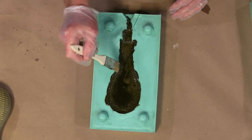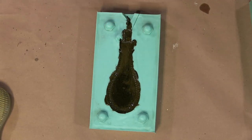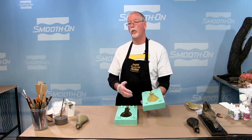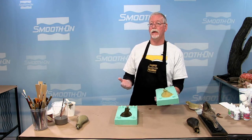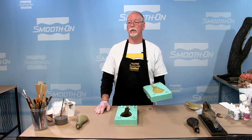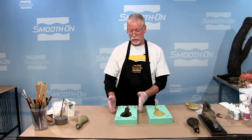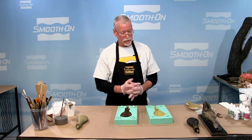And then what you would do is, when that sets, for this two-part mold especially, I would let that kind of set. I would put that together with the other part of the mold, and then I would pour the rest of the resin, and I wouldn't have to use the metal powder in that. I could use just a regular resin. If it was a bigger piece, you could do foam behind it, and you don't have to use as much material. Especially with the foam, you could utilize the expanding foams. So that's a neat technique.